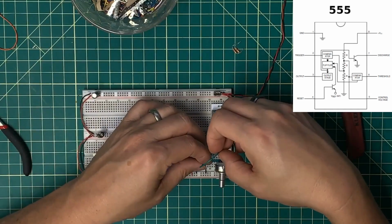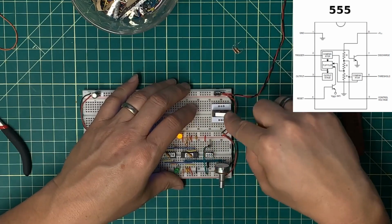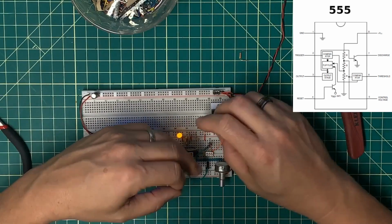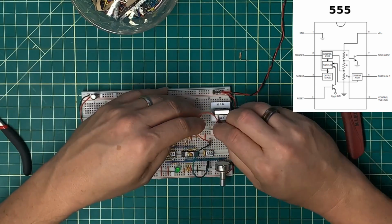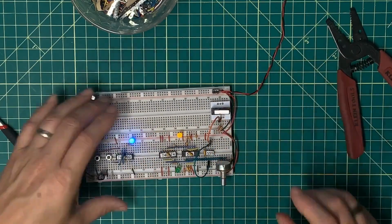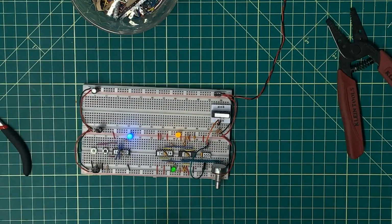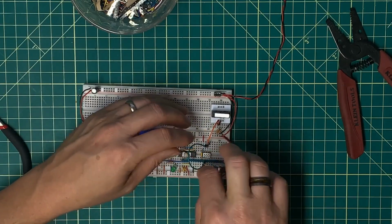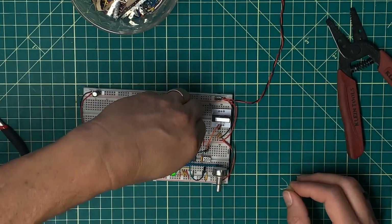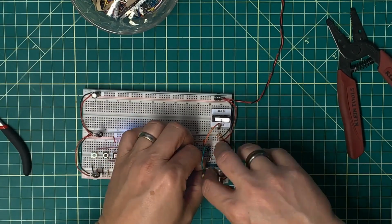All right. Now, 2 and 6, I believe, need to be tied together. I'm kind of making this up at this point because all I really need to do is have 6 connect here to the common pin, and then one of these connections go low and one go high. And so that should do that, hopefully. And then similar here, I believe on pin 2, or pin 6, either of those, I just need to tie a capacitor low. And that should be all I need in order to get output. Questioning if I've got that right or not.